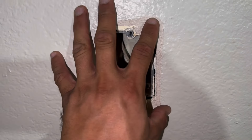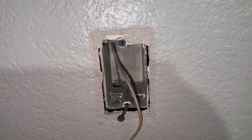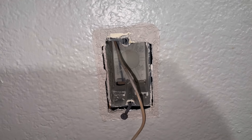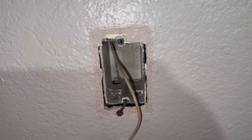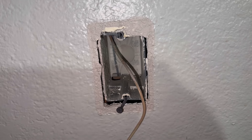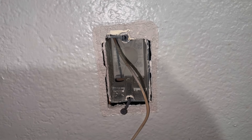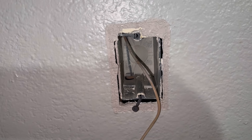What we're going to be working on is a low voltage box — this is for the telephone line. I don't need to utilize any equipment for these; the wires are low voltage so I can start working. However, if you are working on a light switch or an outlet you do want to turn the power off and ensure the power is off by utilizing the right tools.